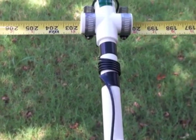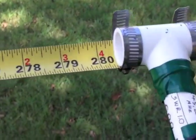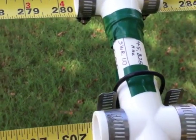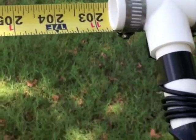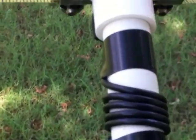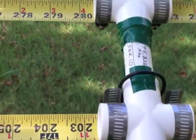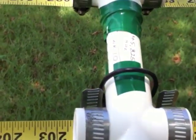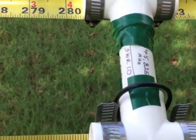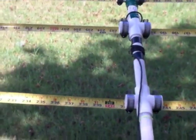After constructing the elements, which are made of tape rule attached to half-inch schedule 40 PVC pipe with T's, and the balun that I have as the cable attached to that, I tuned it using a frequency analyzer — an antenna analyzer — to get an optimum length. It came out to 1.0 SWR for this beam antenna.